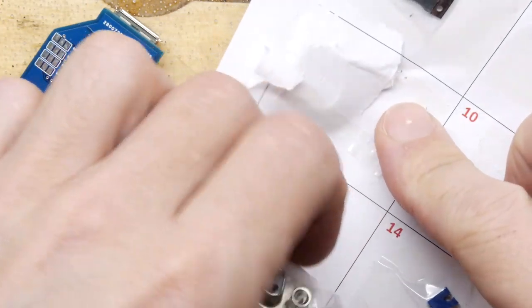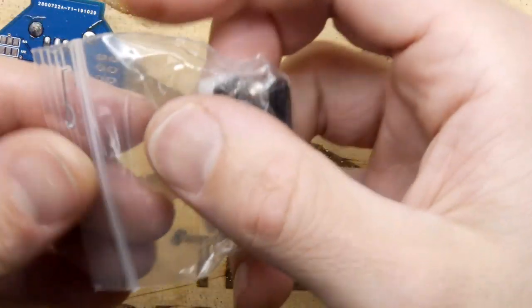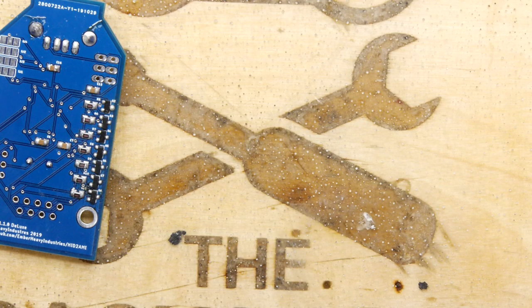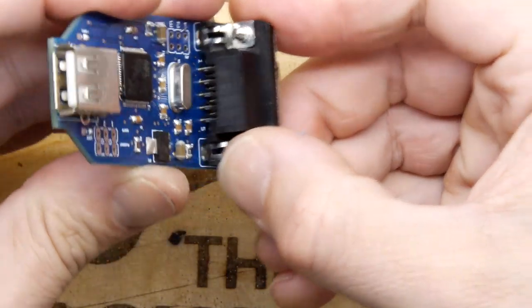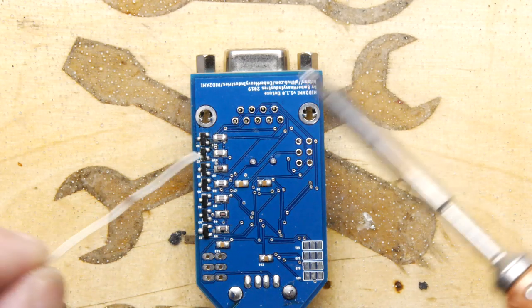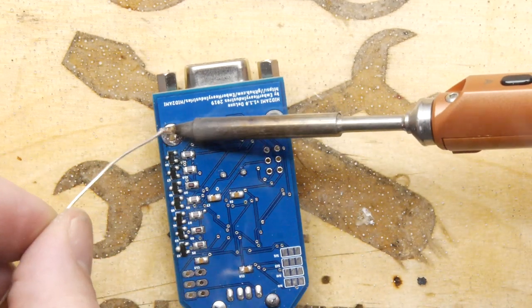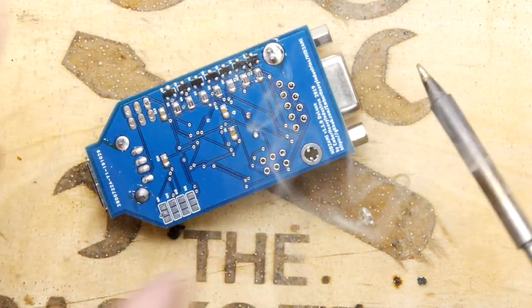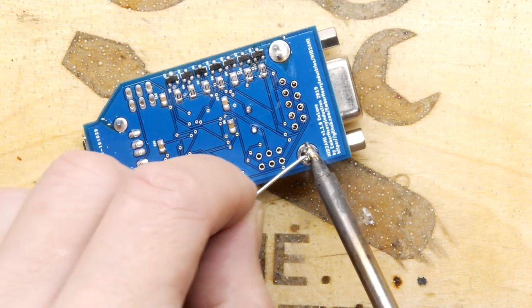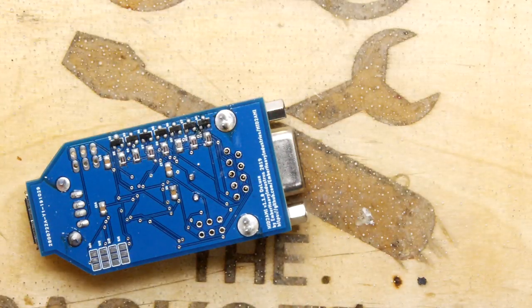What else — we have a joystick port, or mouse port. I think RetroNet uses something similar — it's a serial port, can't remember if it's a male or female variant, but again nice and familiar. What I like to do is flood these, because this is where all the strength of the port is. Make sure they're nicely flooded so that all the insertion and removal forces won't damage it.